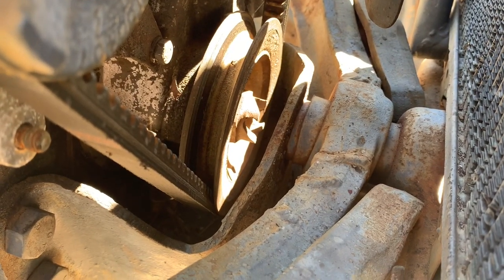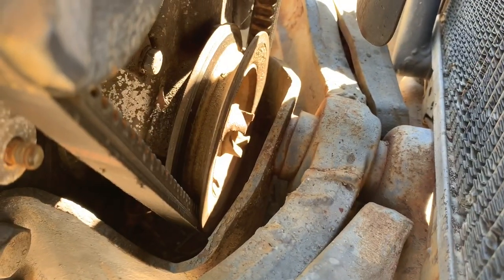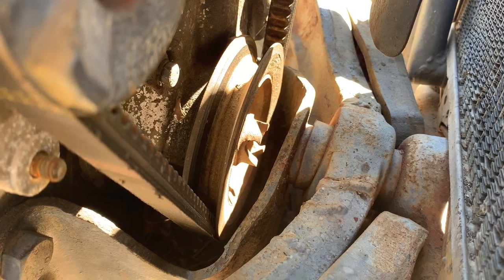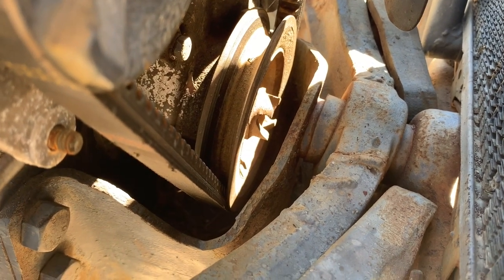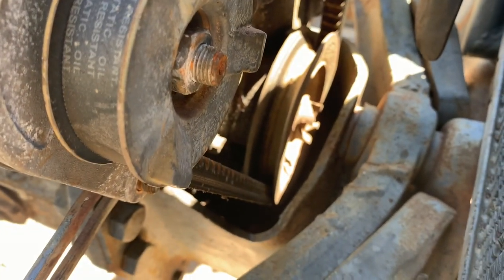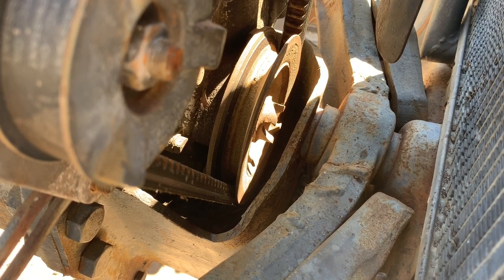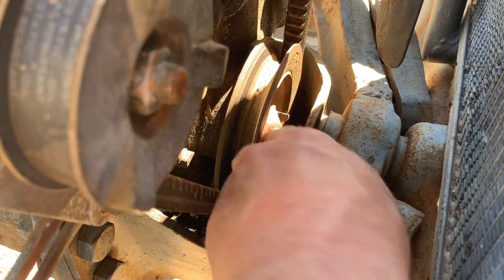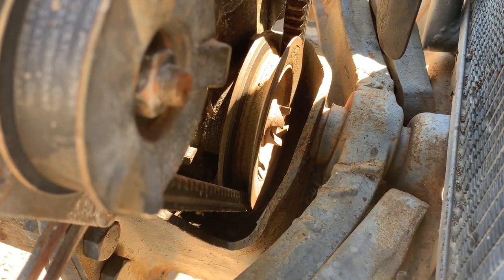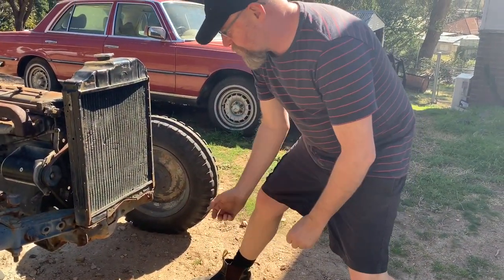It's called the crank handle. So yeah, put it in there. So through this hole into that, on the front pulley wheel there on the end of the crankshaft. Notice that the end of the crank handle, which will be a little T piece like that, will neatly slot into those teeth, and when the engine fires and goes quicker than you can crank, it'll push it out with this sloping edge here, so that it doesn't try to pull your hand off, or break you in the knee.